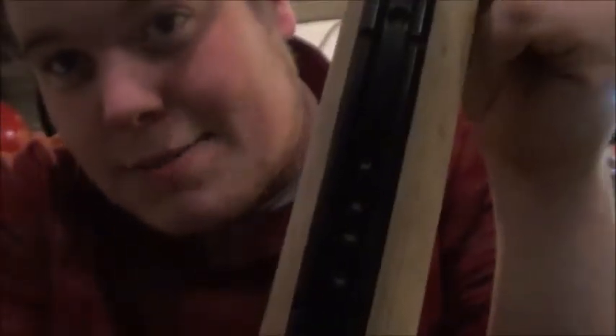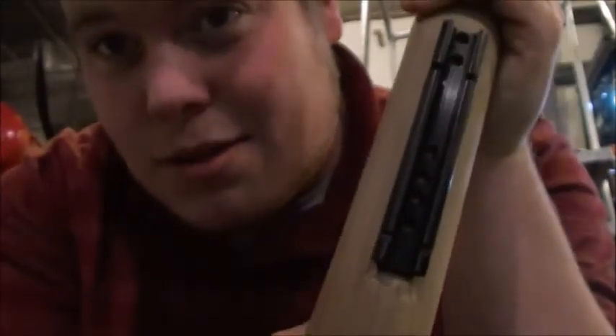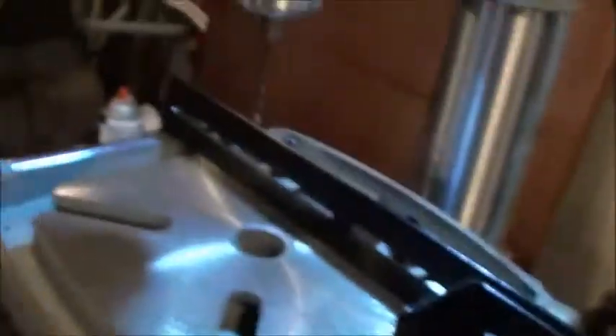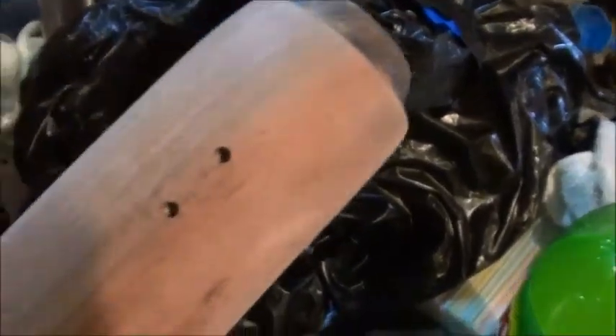I want to put it on record that I did change it. I did drill two holes that I just don't like, but they're going to be under the rail so it's not a cosmetic issue. I might even use wood glue to fill those in, but right now I'm going to drill this as is. It's perfectly level when I hold it on the bipod. I drilled the first two holes on the drill press. The other two holes are not to be drilled yet - I'm going to thread those up, put the picatinny rail in, and then drill those while the picatinny rail is in.